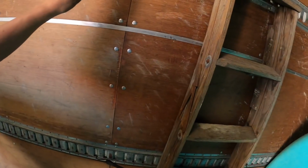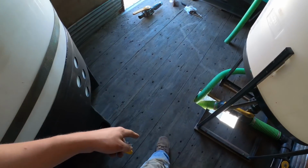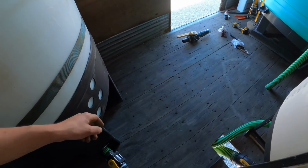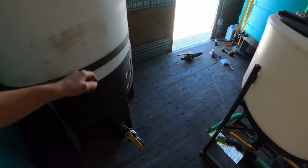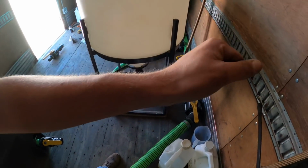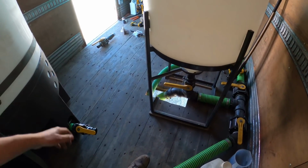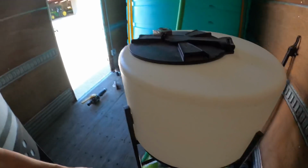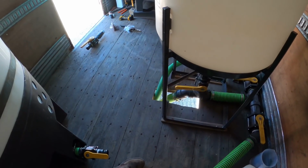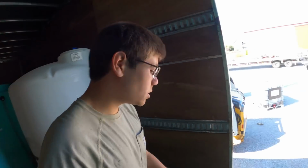Now I'm going to work on figuring out what we're going to do to mount the auto batch pump on the wall here. I'm thinking about putting a T and having a valve there with a hose that goes down with a valve between the two pumps, the 2-inch and the 3-inch. That way we can fill this tank from the ground and have a valve on the end of the pump. That way when we undo this pump, there's not a whole bunch of fertilizer that comes out of the pump. We can close the valve, and it doesn't drain all inside here. Nice thing is we already have the hole cut to bring hoses down there, so we can run another hose down there. It'd be 2-inch. I believe we have 2-inch down in the barn, so I don't know. First, I just want to get this tank done.